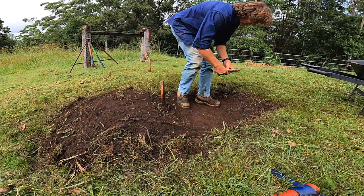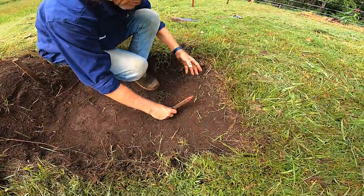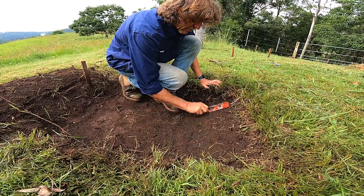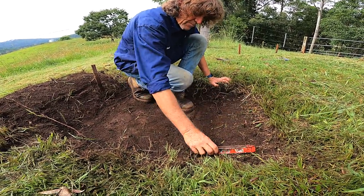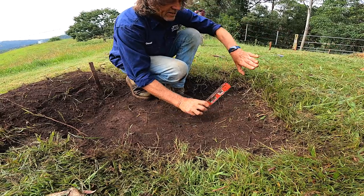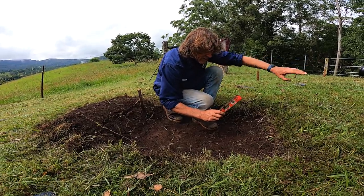On the upside, this is what we call the back cut. Now you can't leave it steep, because the clay in the soil will swell up and shrink in different weather conditions. It's starting to fall in. You want at least 1 to 1.5 slope on most soils. If it's unstable soil, even shallower. So as you get into steep country, with the 1.5 to 1 slope, you're going to have more back cut because you're in steeper country. You're going to have more angle to lay back. It will be the same angle, but it will go further because of the steepness of the slope.